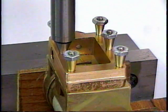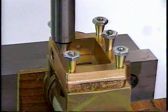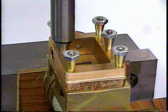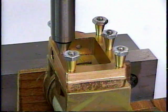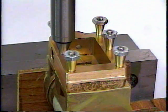And it works in 2 directions, so we can see in the other direction. Nope, it's not lined up in that direction. And when you adjust one direction, you tend to mess up the other a little bit, so you have to readjust it a couple of times. But eventually it looks and feels like one piece, and it says that if we drill and tap a hole right there, it will be the correct place for the 6th mounting bolt.